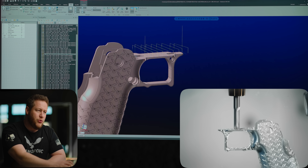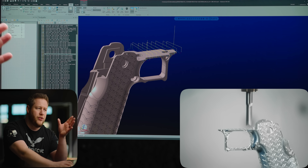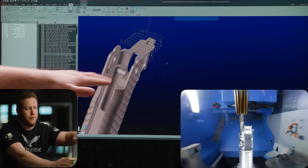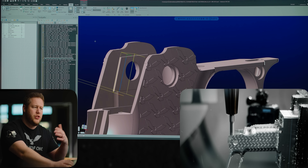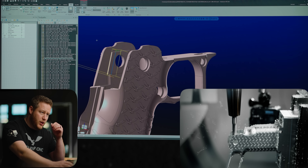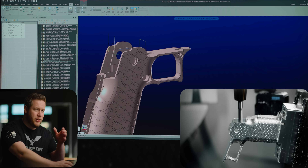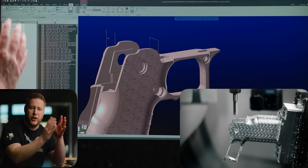Once we do that, that same tool is going to step up and do the finish pass on this top floor. I'm using the same tool for the top floor as well as the inside because I want these two floors to be married with each other. We'll also rotate down and machine this inside wall. I'm machining as much as I can with that 3/8 end mill, then come back with my grooving tool with only minimal material to take out. Then I'm going to do another final pass at the top just to make sure there's no springing involved, because like I said, these walls are getting very thin.